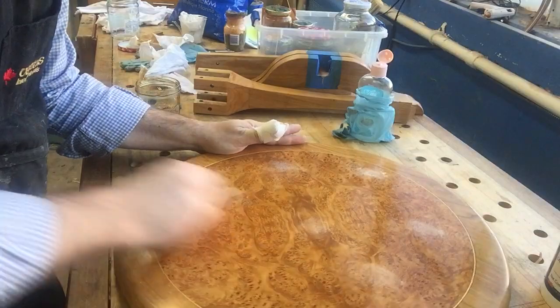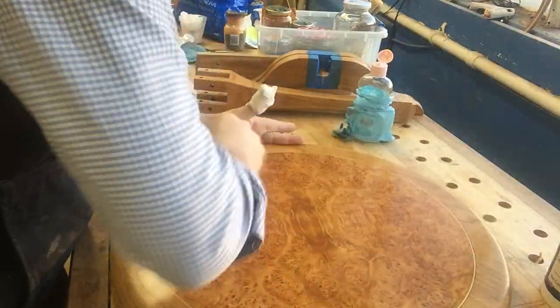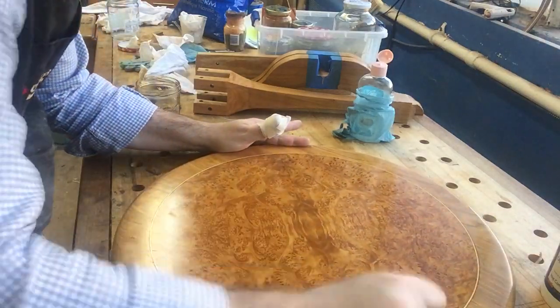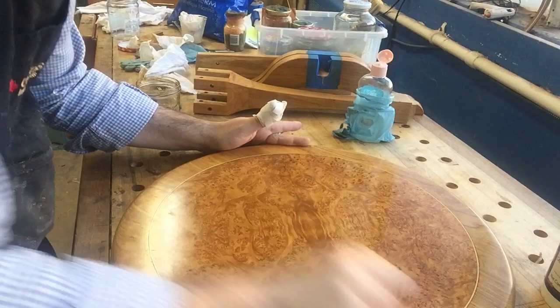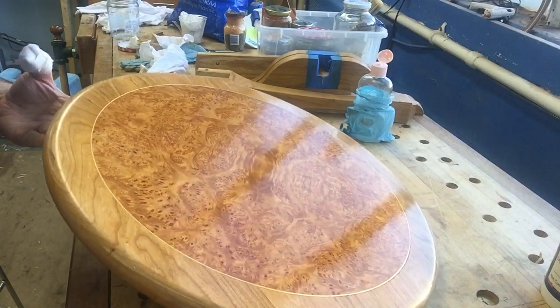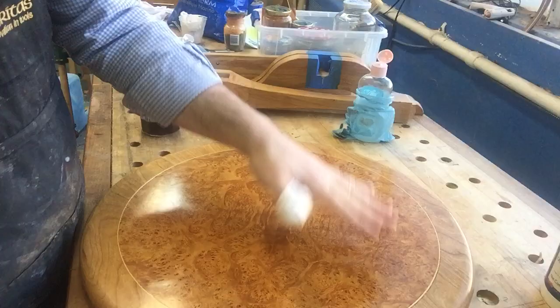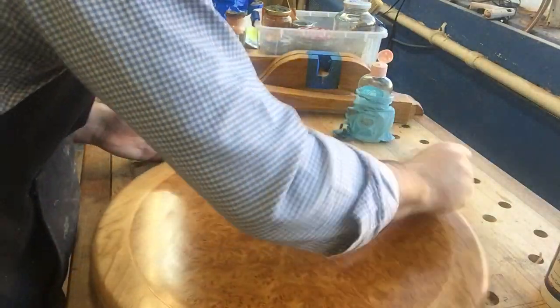What I'm going to do is just rub this in. If the pad starts to stick I'll add a drop of baby oil. I'm picking up the pumice with the pad and it's moving pretty freely, so I don't need anything more than that. I'll keep going until the pad starts to drag or judder across the surface. I've got a window right here so I can lift it up and examine the surface for any defects. It's looking pretty good — a couple more tiny pot marks to focus on. This is a four-way bookmatch so the grain isn't really relevant here.